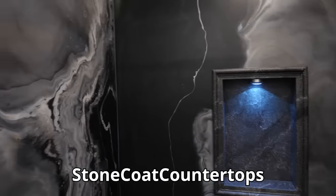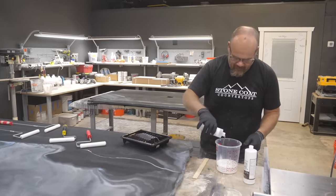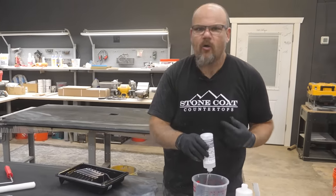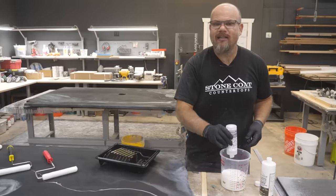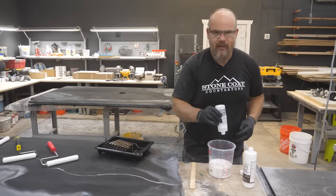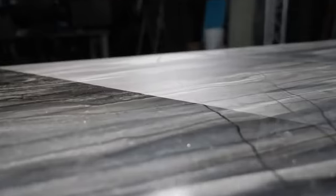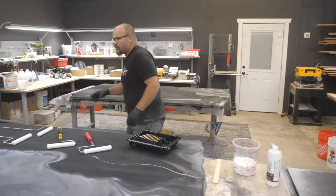And it gets us complete with these giant shower panels. So what we're gonna do is tag team this. Because they're so big, Mitch is gonna do half, I'm gonna do half, because the key is timing. You don't wanna back roll over and over again. You wanna do it as fast as you can per panel, and then move on and leave it alone. You're gonna be tempted to touch it. You'll see lap lines when it's fresh. Let it dry. Follow our top coat video if you need super in-depth clear instructions. But honestly, don't make it overcomplicated. It's not that hard. Throw me the water.